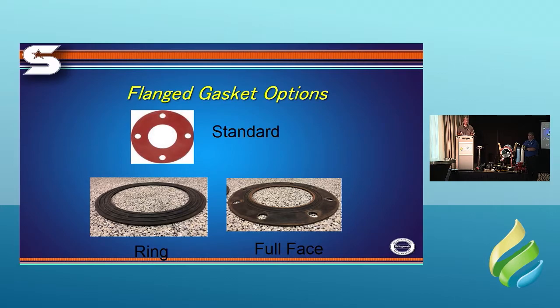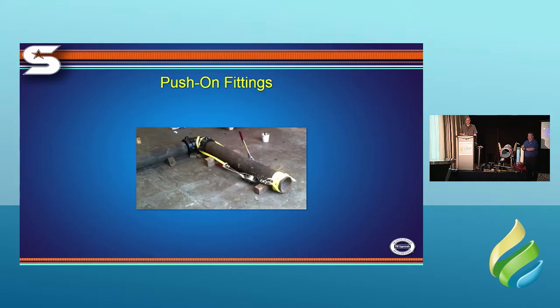That's an important thing for inspectors especially to know, because I've had numerous calls that have said, look, it's supposed to say 350 on the fitting. No, it doesn't say 350 on the fitting. The fitting in the standards has to say 250 on it. So if you ever have that problem, have them call me.